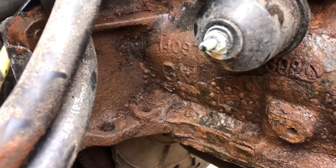Before we put the interior back in, I wanted to address some issues with the engine. It runs - it's a good engine, a Mercury 3 litre. As is very common with many of these engines, it's suffering a fair amount of surface to moderate corrosion in places. It's an iron block, cast iron, and we get salt water in there. This will all be dressed and cleaned up with a wire brush, then we'll add some rust converter and a little lick of paint to keep the corrosion at bay and make it look pretty.